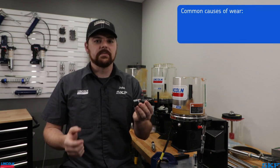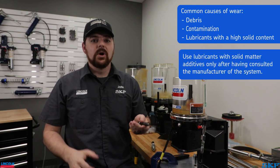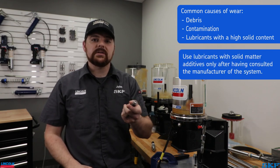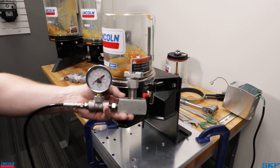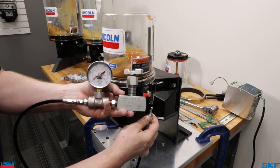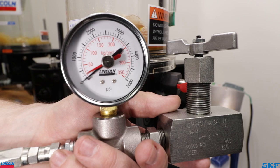Elements are wear parts and may require occasional replacement in the field. Some of the common causes of failure are debris, contamination, or lubricants with high concentrations of solids, which will wear the pump piston over time and lead to loss of volume and pressure. If your system is failing to cycle and the controller is displaying fault codes, test the element by attaching a gauge and ball valve to simulate building pressure in a supply line. Failure to achieve pressure indicates the element requires replacement.